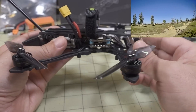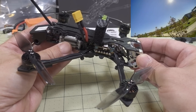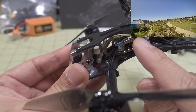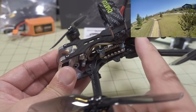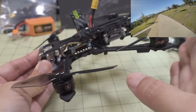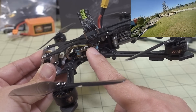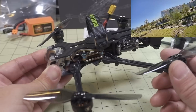I'll put a link to the CLI dump in the description. I wired mine up for the DJI controller rather than using Crossfire with my Tango 2. There's a pre-soldered four-pin plug for Crossfire on UART1, but it comes pre-wired for the DJI controller via the Vista unit. If you want to add Crossfire later, you'll likely need to desolder the S-Bus connection on the Vista to avoid a conflict, since both are on UART1.